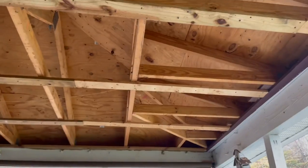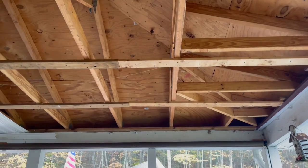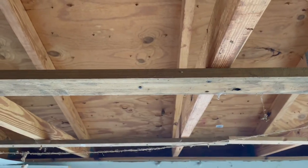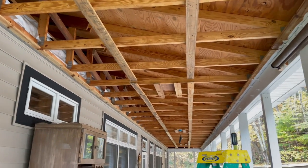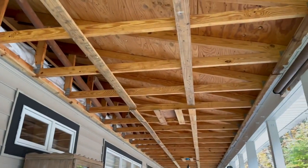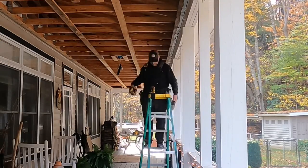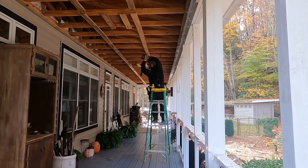I owe you one. I got this section ripped down, and the first thing I'm seeing is that it looks like they have one-by on the rafters, and then they have the actual siding nailed to the one-by. Huh. So I did just talk to Eric. Jamie didn't answer his phone, so I talked to Eric, which I guess is just as good. So I think I'm just gonna put the plywood right onto these one-bys. I gotta get some screws out and tighten up some spots where the one-bys are flopping. I'm gonna put some scabs in there and make sure the one-by is tight everywhere. And we'll be ready to put this stuff up.